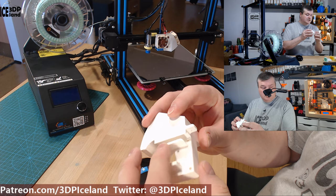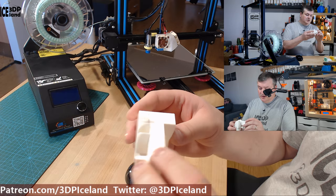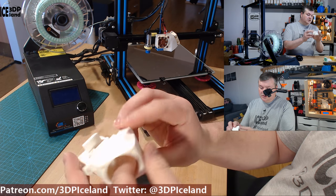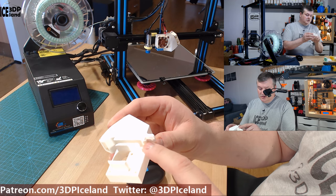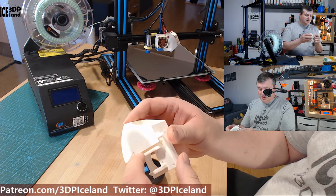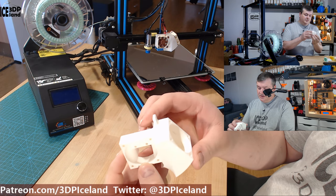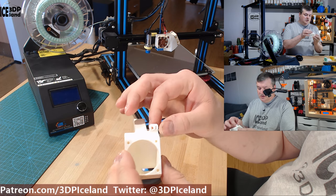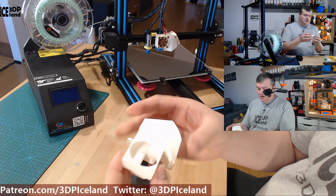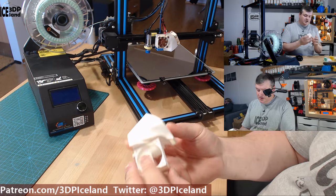This part covers the sides of the hotend cooler so the air will blow through the hotend part. Then I have the part cooling fan mounted here — also a 40mm Noctua fan — and it blows air through this duct underneath, and the air goes out here. The cables from the heater element and the thermistor go up in here, and this groove is rather tight to hold the cables in a good position. On top here is a piece where you can put a cable tie to hold the cables for cable management. This is printed on the bed with supports for this part, but the inside is designed so that no supports are needed there.